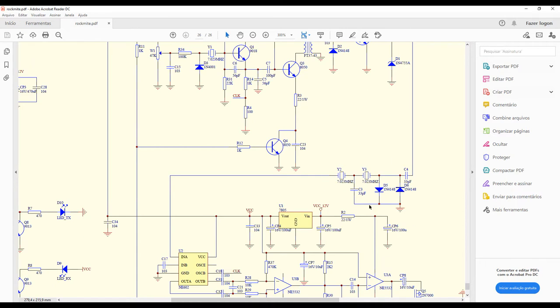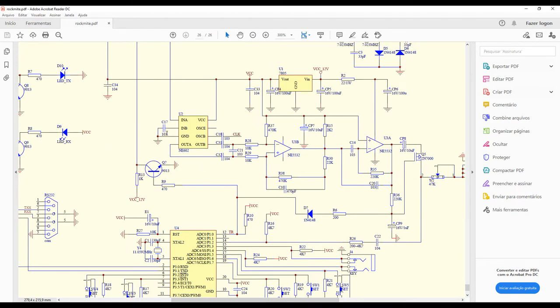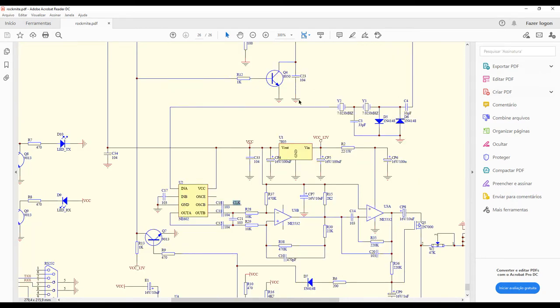We will replace this filter here completely. I will leave the diodes here, but I will replace these components. Otherwise, we would have a narrow filter at the frequency of 7.023 megahertz, and we want to move to the 40 meters band range, so we have to replace this with another filter, instead of the mixing part. The NE602 we keep because this is very important, it is where we mix the DDS input frequency with the incoming receiving signal.